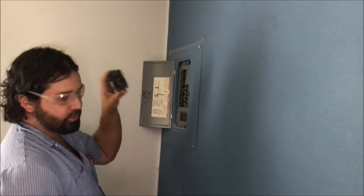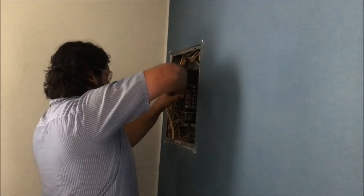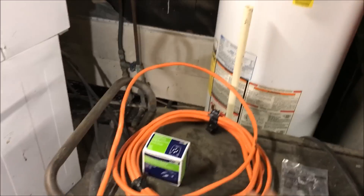We've got to go into the panel to change this breaker — if you do not feel comfortable, do not do this. Okay, power back on, turning the breaker on. We used our washer and dryer plug. Now we have a 10 gauge wire with a 50 amp breaker — it should be a number six wire. We cannot use this for our dryer; if you do that, you risk burning your house down. That's why electricians say there has to be a dedicated circuit for the welder. Make sure you at least buy 50 amp plugs — I bought a new plug that's 50 amp, 250 volt.